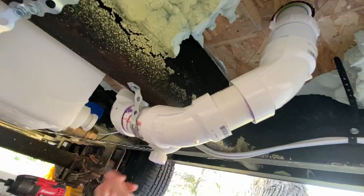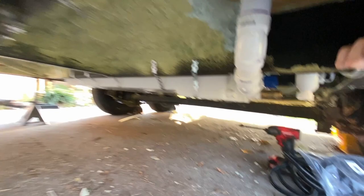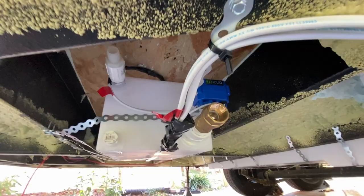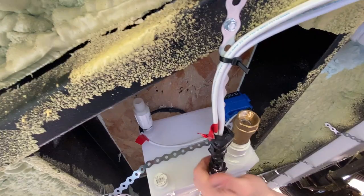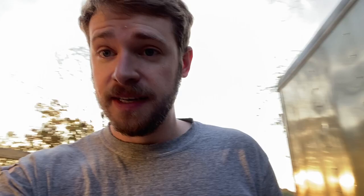On both tanks we've got plugs, the electric ball valve so you can flip a switch to drain it. We did the same thing on the black water tank for the toilet — urine will go into the black water tank, and we'll attach the toilet with the hose. Electrical tape is covering all the wiring. I think I am ready to pressure test the plumbing, which is nuts. I've got my water hose all hooked up with a Camco pressure regulator — just a little pressure regulator so not too much pressure goes into the system.